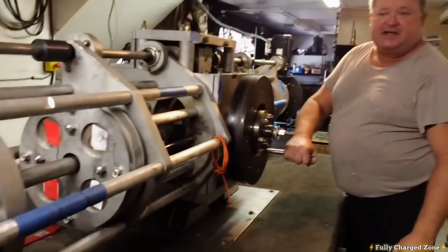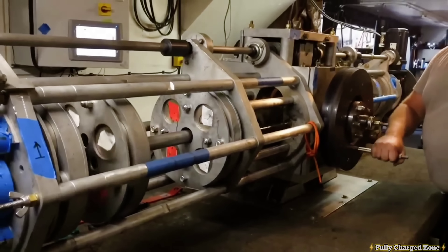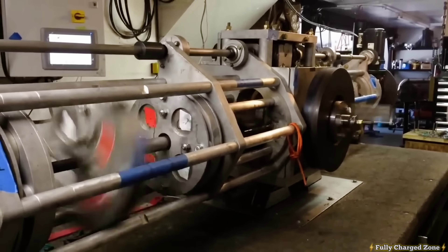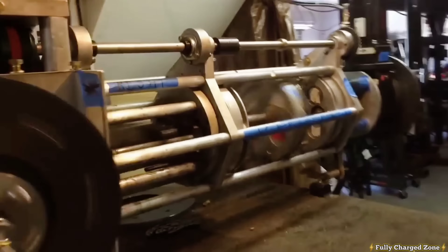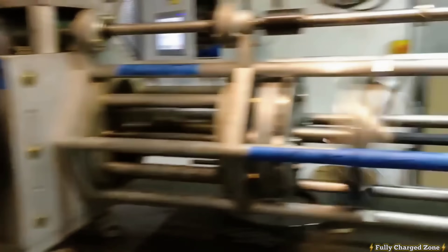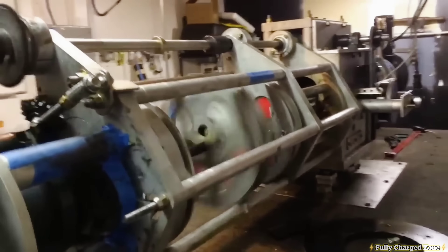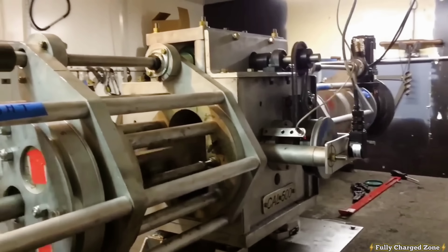All right, and now this handle is for demonstration purposes only, because as you can see, we are in time. See everything moving at the same time? Now, as a generation one, we have achieved the miracle of self-starting. It's electronic timing only. And you can see our encoder, our crank trigger — everything is all working perfectly. Again, electronic timing — this is tape number one.